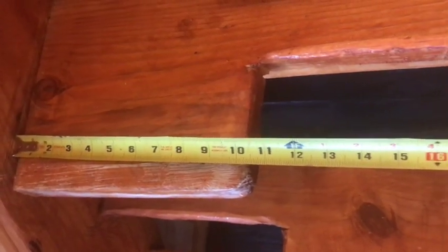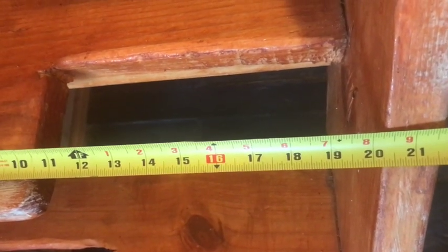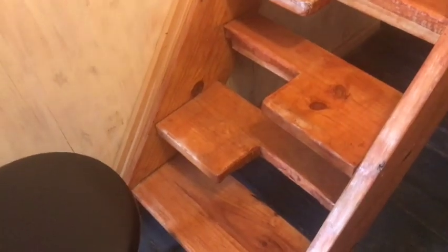You want to figure out how wide you want your stairs to be. I wouldn't recommend making them any less than 20 inches wide, just for safety. You need enough stepping room to get up safely. You also don't want more than 7 inches of rise between each stair, so the stairs aren't too steeply aligned. To figure out how many steps I needed, I took the height of the loft — 5'10" — and divided it by 7 inches.